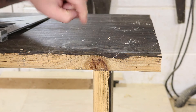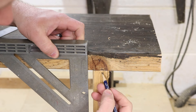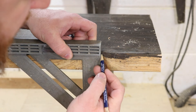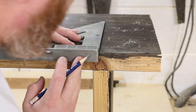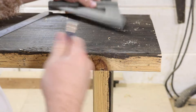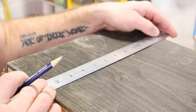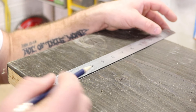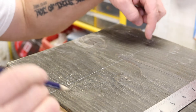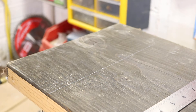In order to put the screws in here, I want to make sure I'm in the center of the board. To do that, I'm going to take a carpenter square, go pretty much right in the middle, find your line, score a little line, then bring it up matching it and making your mark. You can continue that line on the other side if it's not long enough. For the screw holes, we've got our line, so we're going to come in two inches from the end and then four and a quarter. We're going to repeat that on both sides, which will end up with four holes that are roughly evenly spaced from each other.